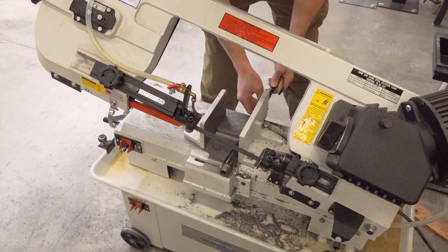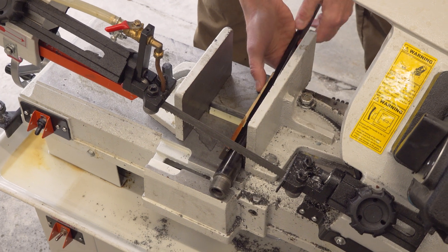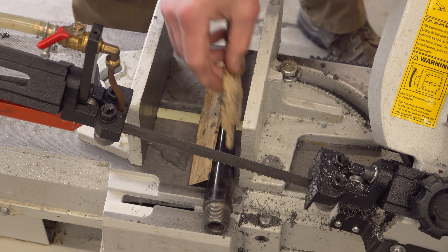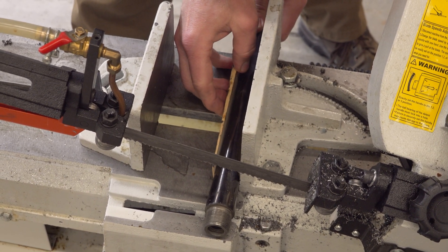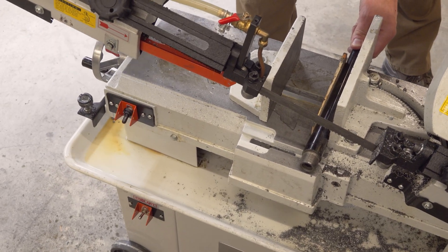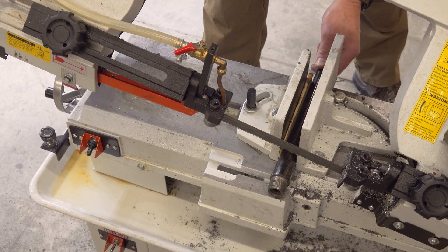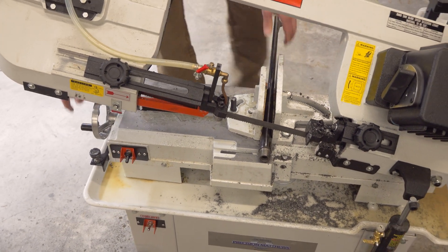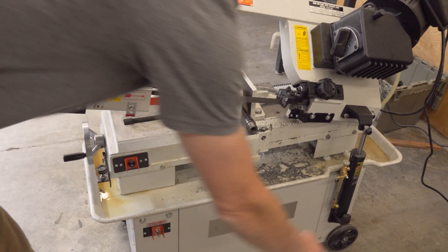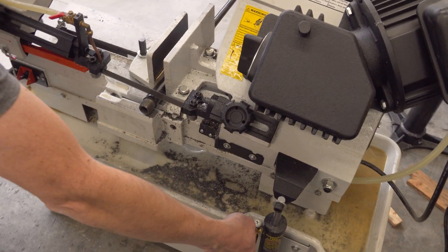So I'm going to show you how easy this is to use and how effective it is for cutting barrels. I'm just going to put the barrel here — we'll cut the shank area where the threaded tenon is. What I like to do is put shims in place here to account for the taper of the barrel. This has a really nice vise feature. If you loosen the vise a few turns, you can take the other vise jaw, move it into place, and when you tighten it, it engages and clamps down. Make sure that's clamped plenty good. Turn on our coolant and ease it down to where we're going to start cutting and let it rip.